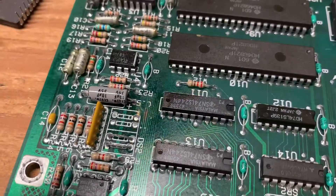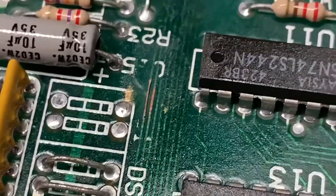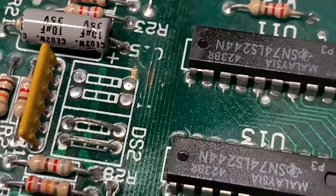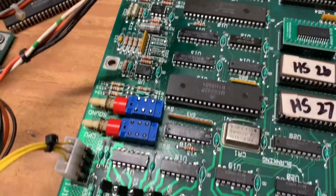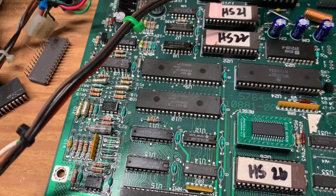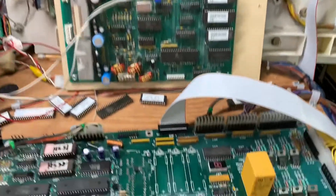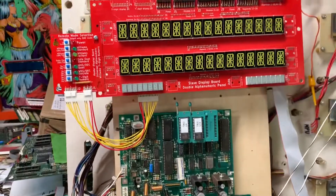We are back on the bench. I tack-soldered a piece of fine wire across that trace — usually I'm not in favor of tack-soldering, and I may in fact add a longer jumper to this. It's got to go all the way from U17 here all the way up to U10. I'll do that just to be redundant. We have replaced this 2.2K SIP resistor at SR16.